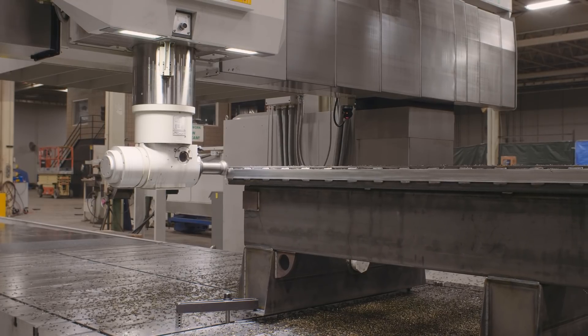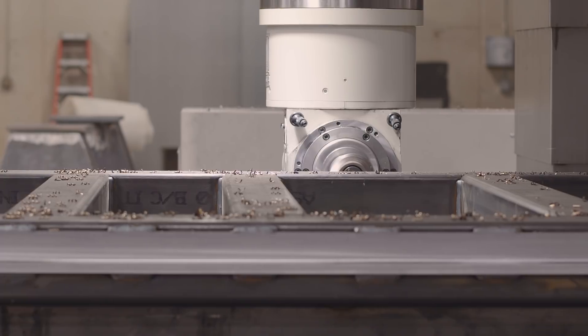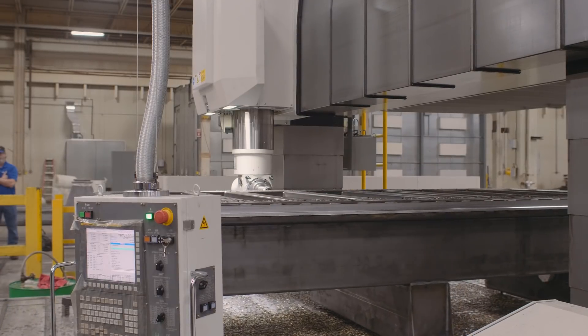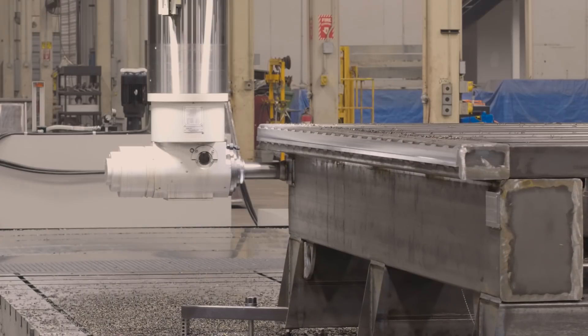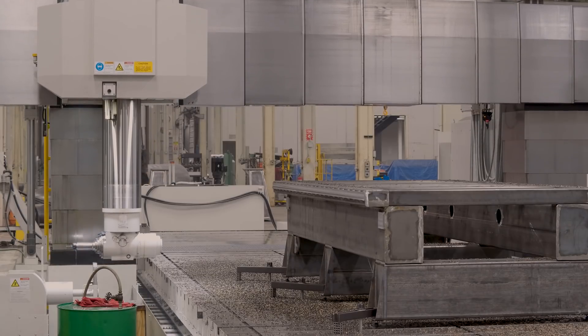Well, what are we really machining? Typically we're machining where the precision components mount. For instance, we're machining where we mount precision contour guide rails, because that machining actually determines the accuracy of the guide rail itself. Similarly, we're also machining surface mounts for things like the ball screw mounts, and that's how everything lines up. The beauty of all of this is that once you do it in a single setup, the machine has the accuracy of the mill that you're making it on.